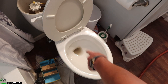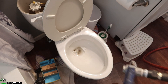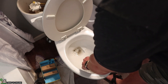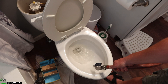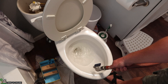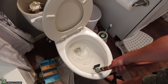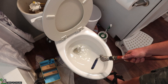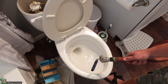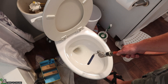Now you don't have to fill the back to flush the toilet. If I put this hose in here, this is probably enough water to get this to flush by itself. Let's see if it will. There we go — that toilet paper is gone now. So that just flushed things back down using water directly into the bowl.